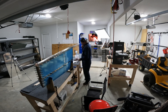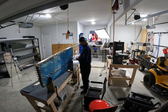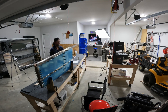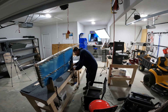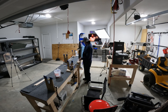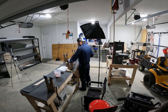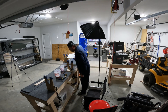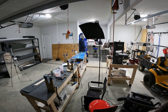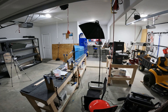It's not a perfectly symmetrical assembly, so there's a definite top and a definite bottom. Where that's most noticeable is where the two halves of the front spar come together — those reinforcement angles and splice angles have different hole patterns and a different shape. At some point I ended up putting one of those angles in upside down, and it fit well enough that it wasn't any trouble to get it in. Then somewhere in here, as I'm getting into it, I noticed a couple of holes — I thought I'd forgotten to match drill them — without noticing that the reason the holes didn't match is because it was, in fact, upside down. So I get to redo all that all over again.